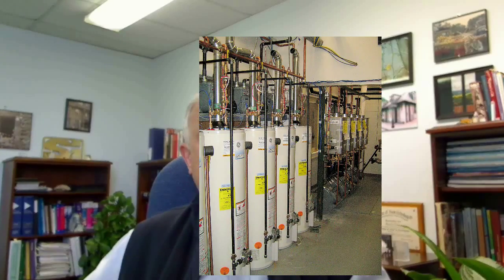There were large electric storage water heaters, natural gas storage water heaters, and the newer generation of indoor instantaneous water heaters — the tankless water heaters. The results of these studies showed that with softened water, gas and electric water heaters maintain the original factory efficiency ratings over a 15-year lifetime. While on hard water, the heaters completely failed to function because of plugged-up scale in the plumbing, after only about a year and a half of equivalent hot water use — about one-tenth of the useful life of the appliance.